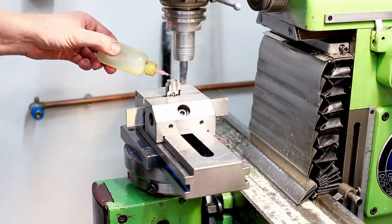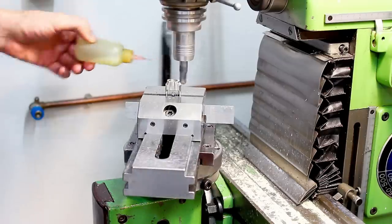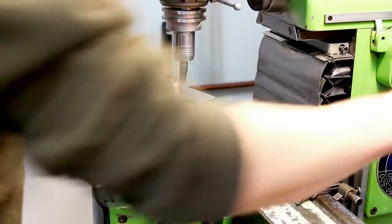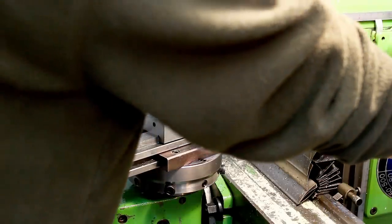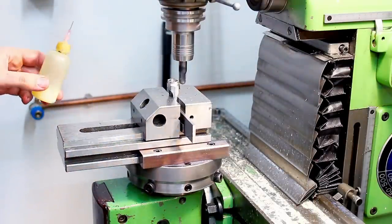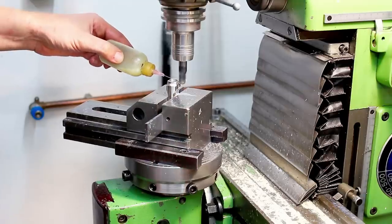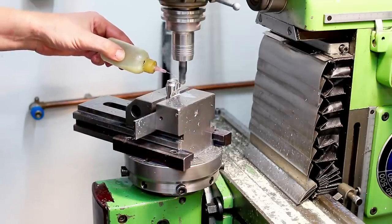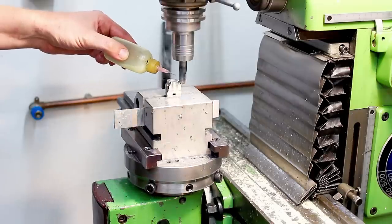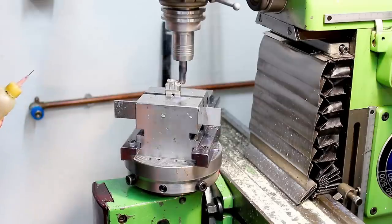on the rotary table. I'm using the grinding vise for work holding. I slid it around on the faceplate of the rotary table or the indexing head until I got the part held in the vise to center, and then I just used the carbide ball end mill to plunge down and rotate the table at the same time. That way I created this large fillet cut on the back.